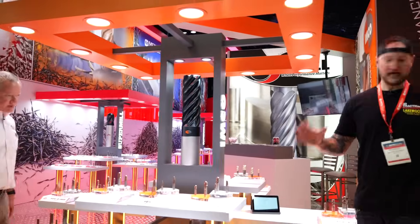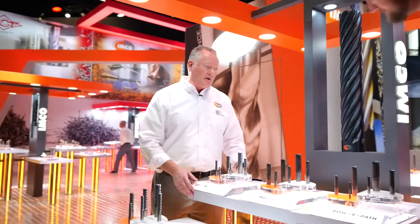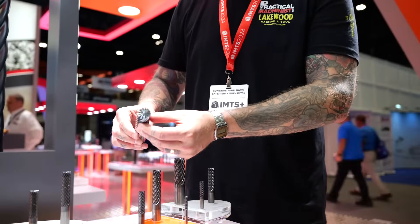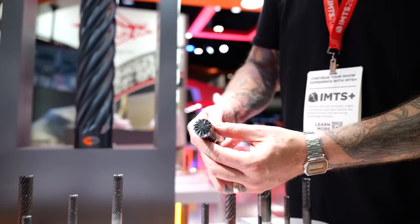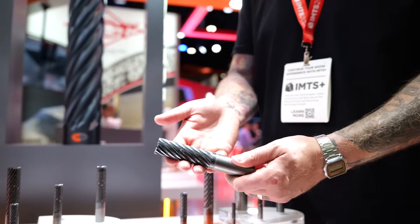And of course, it looks like you guys have a lot of other tools here — this is a very large booth. We have our tried and true products that we've had out for a while. We've talked about high efficiency machining — IMCO, in our opinion, has been a leader of that in the industry for quite some time. So we have seven, nine, and 13-flute end mills. You're probably not running that 13-flute on your small 40-taper machine, but even a seven-flute end mill can run on lighter duty machines. That's the beauty of the HEM toolpath — you can make a high performance machine out of a more pedestrian machine. You don't need all the horsepower, but you can still get a higher metal removal rate than running traditional toolpaths.